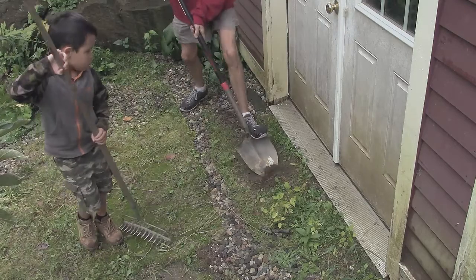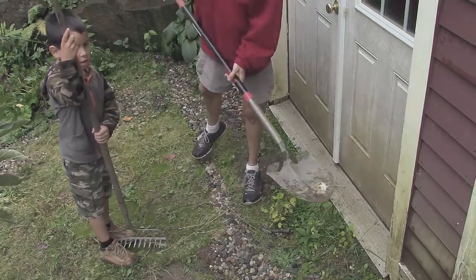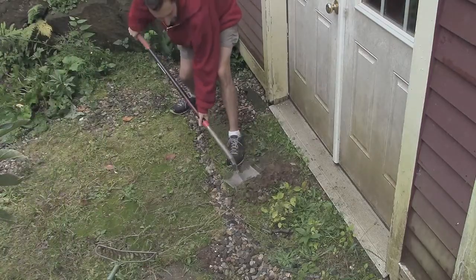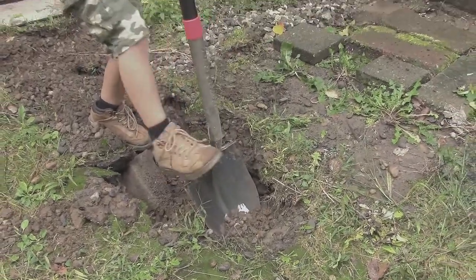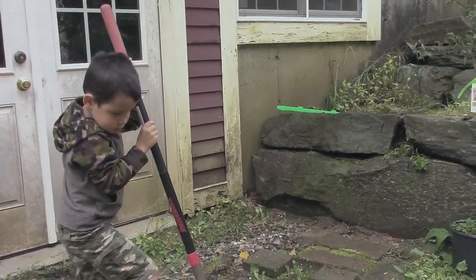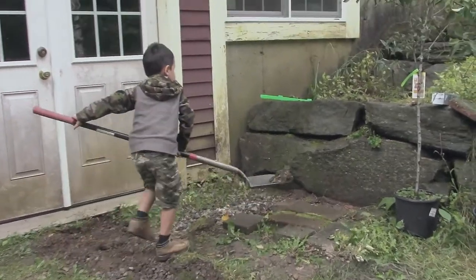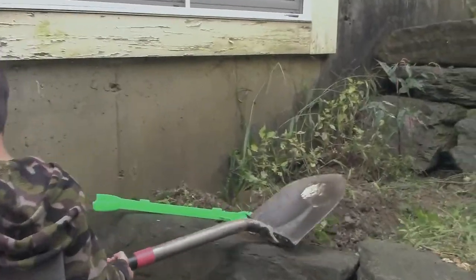What I'm doing today is digging a trench from this area to try to drain it down. Then over time I'm going to widen out that trench to get the entire area around the house set down a little bit. The reason I'm not just digging down right around the house first is because then it will become a pool, a puddle. I need to first make sure that any water that collects there has a route down and away from the house.